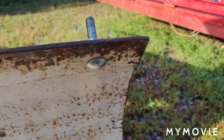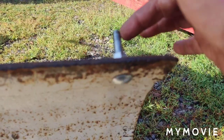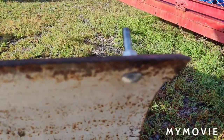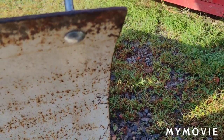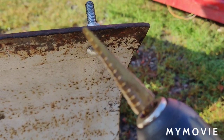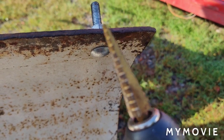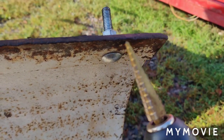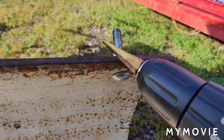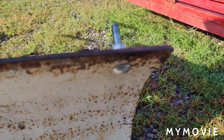This is not going to be as bad as I thought. I took a drill bit and drilled through the plow to the next step up from three-eighths. This way the bolts go through the hole pretty good. On the bottom I took the step drill bit and reamed it out all the way, and I was able to get the carriage bolt in with good support. Since they didn't have the right bolts, after I get all the bolts in I'll just cut off the excess. I'll do one on camera and then do the rest.